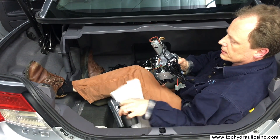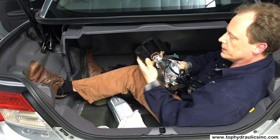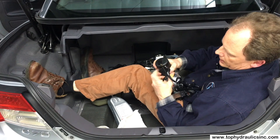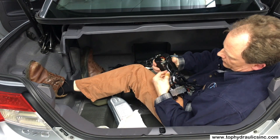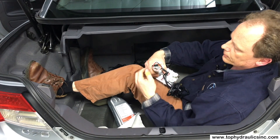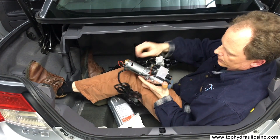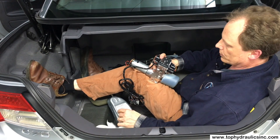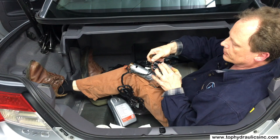I've already taken the plastic cover off the motor — it snapped together and you just get your fingers under the cover, unsnap it, and take it out. You'll see there's a red dot where the red motor wire goes. Take off the red and black and disconnect the thermal sensor. Then just pull the four wires off the solenoids. If you have a small flat screwdriver, put it in here and lever it up and the wire comes right out.